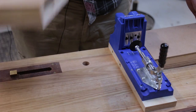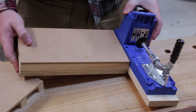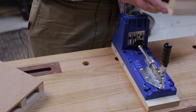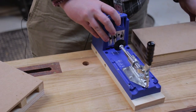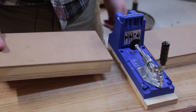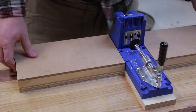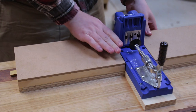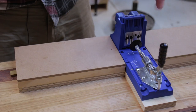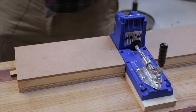These are now dried and cleaned up. I was going to put some dowels in to sort of lock this all together so it's stabilized, but I found that kind of doesn't matter. If I crank down my tail vise really hard it will bow up slightly, but the solution I found was just not to crank it down. It really only needs to be snugged up, and then all the force is kind of going down anyway so it just doesn't move. So I'm going to skip the dowels — it's unnecessary complication.